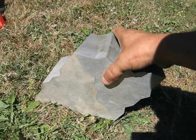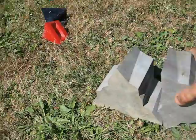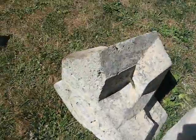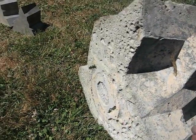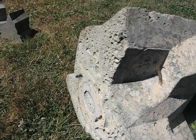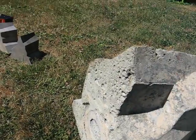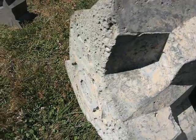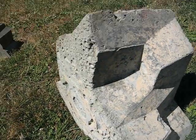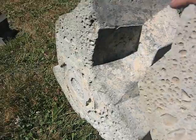But I thought, how can I get a better interlock so it can't slide this way at all? That resulted in what I call the dual inverse mirror plane, which we have right here. We've got the same original inverse mirror plane this way, and there's another one running this way, so that this sticks into here and this goes into there. Each one is the opposite draft, and it can be produced on a two-piece mold without any undercut. When you put these together, they completely lock in place.